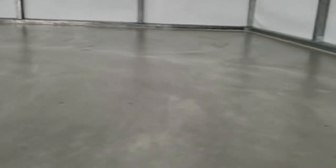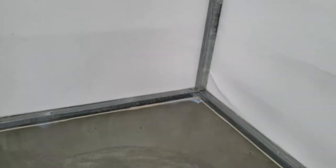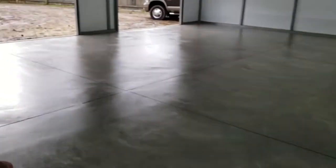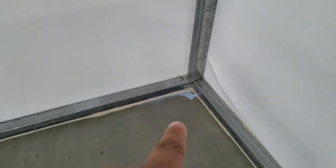So I'm out here about to get started and apply the second coat. I just wanted to give y'all a close-up. I don't know how this camera picks this stuff up, but it looks like a real satin look almost when you get up on it. This has been about four hours since I applied the first coat, and it does feel pretty much dry to the touch. I am ready to put this second coat on. This is what I was talking about — when you apply this stuff, you really got to make sure that you get this buildup handled. I had other spots around here that were like that. If you leave it like that, that's how it's going to end up drying.